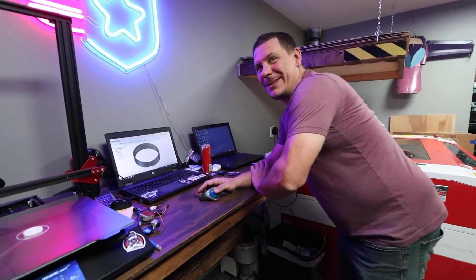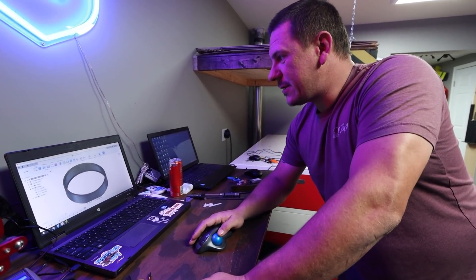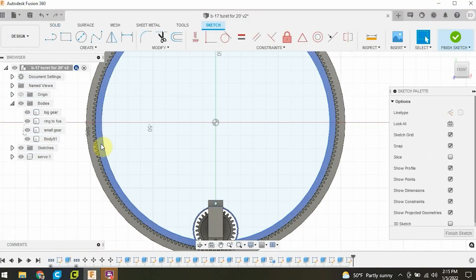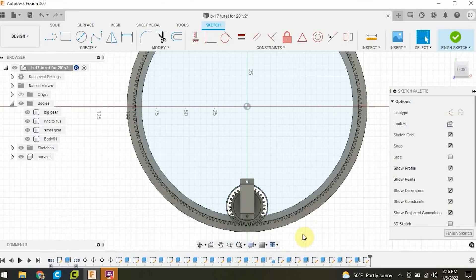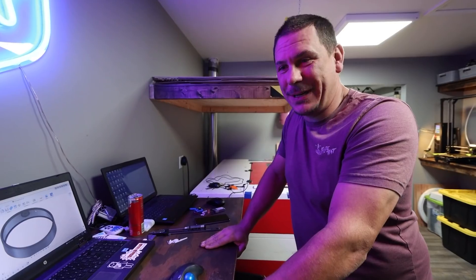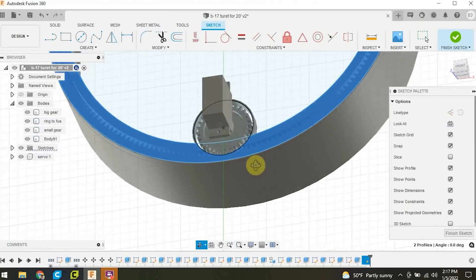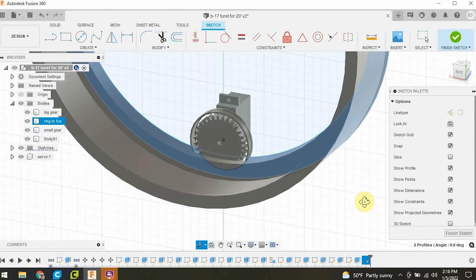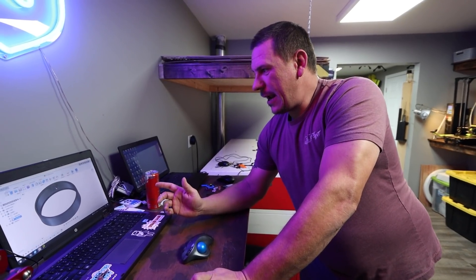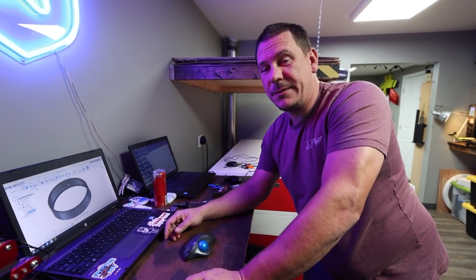Hey Dave, what's going on? I heard you working on the turrets. Yeah, I'm just getting started on them — basically just starting out making the gears and going to work off of that. It's a lot of 3D printing; they're really big, a lot bigger than I expected — 200mm round. After I get done with the gears, I'm going to take our 9g servos, turn them into continuous drive, and add an FPV camera and laser tag, and hopefully it'll be done.